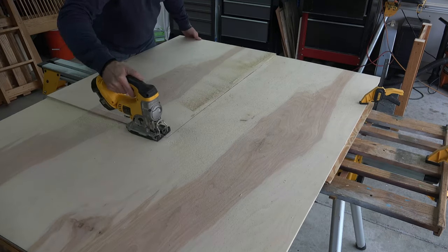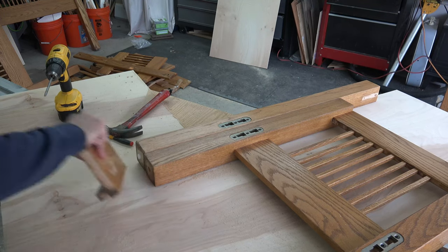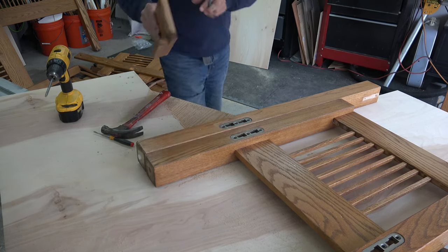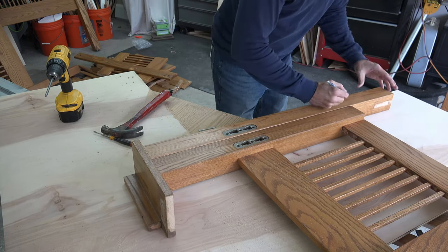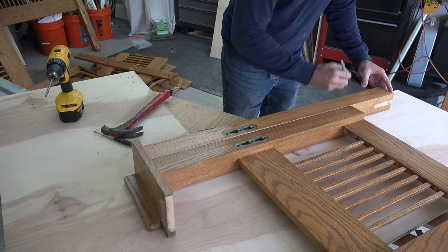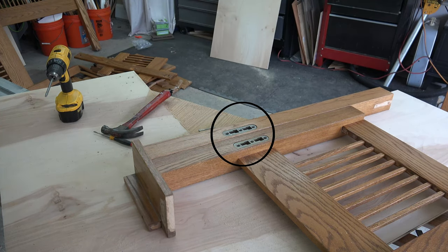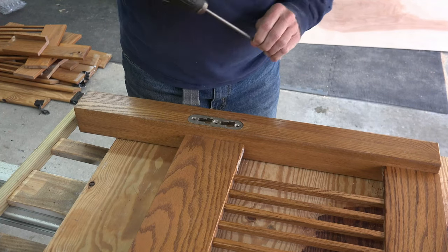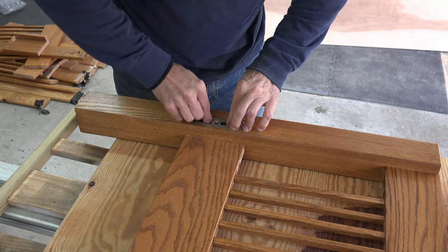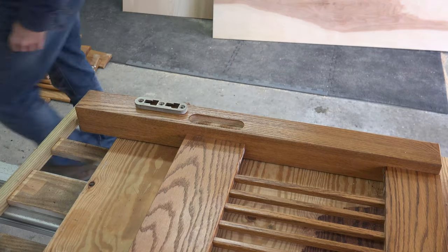Your middle leg will be a standalone leg, but it needs to be the exact same size as your other legs. So I laid it beside one end of the desk supports and marked it. I used a scrap piece to make sure I was flush before I made my mark. Also, make sure you align your locking brackets when doing this process. Next, you need to take out one of the locking brackets for the adjacent side of your standalone leg. It should screw out easily.